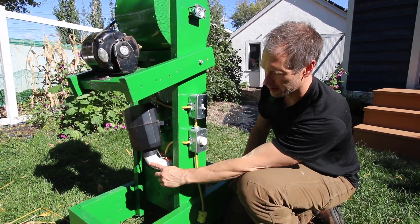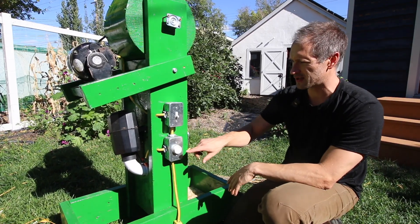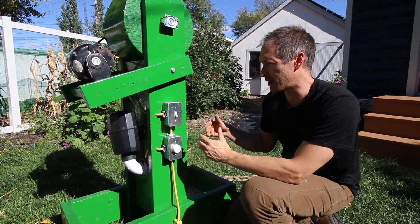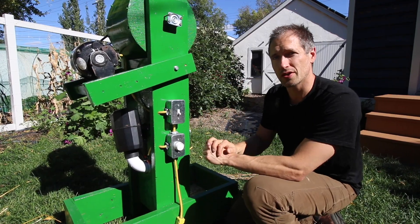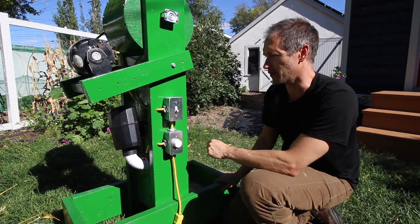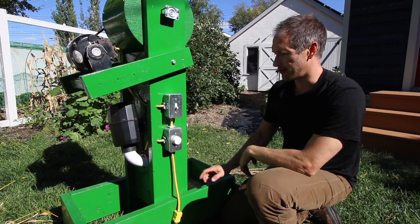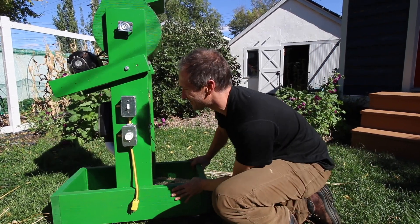The blower provides forced air down through the white tube you saw on the other side. We control both devices with just two switches. The first is a dimmer switch for the fan — very important because it lets us adjust the fan speed to just the right force so that grain falls while chaff rises at that key separation point. This will be different for different grains, so it has to be adjustable. The motor just runs at a constant RPM with a simple on/off switch; if we want to change that, we change the gears. Both are electric, so we plug them in and can back them with our solar panels — no emissions from this threshing machine.